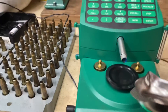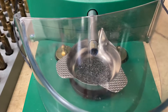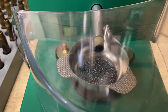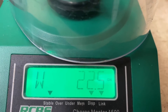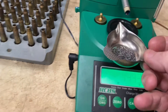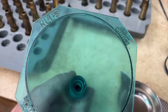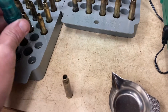We'll put this up here and I'll show you how this works. We already have it programmed in here and, if y'all notice, it's dispensing that powder. We're looking for 23.5 grains, and when it gets close it's just barely trickling out — it'll give us an exact load. See, it's at 22.5 right now. It will beep — that beep lets us know it's ready. So now we can open the door, get our powder out, and dispense it in there. The powder doesn't go all the way down immediately; you have to work it a little. Once there's no powder left in the funnel, we're ready to put it back on the next round.